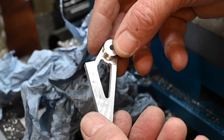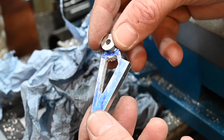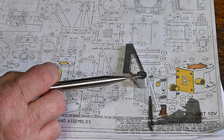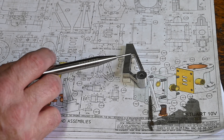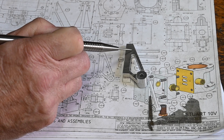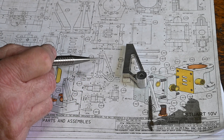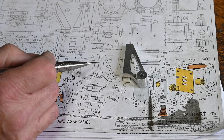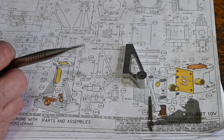It's not looking too bad considering — a little bit of filing and a bit of clean up and I think we'll be there. That's the finished bracket apart from the full size hole which I'll drill in later on when I assemble it. It's not turned out too bad — I've got a different radius here to what the drawing shows; they've come a lot further with a smaller cutter, but I'm quite happy with how that's turned out. It's pretty cosmetic anyway, it doesn't really matter. The important dimensions are there — the overall dimension. It's just this internal shape which is purely decorative anyway.